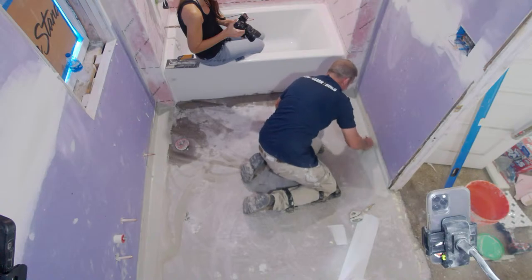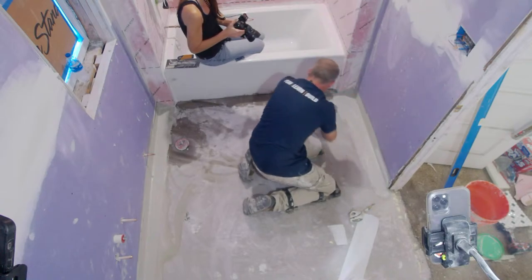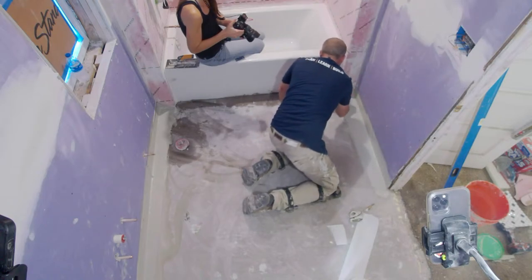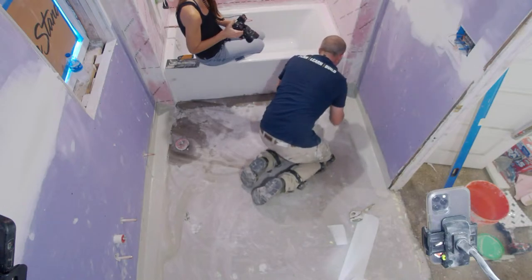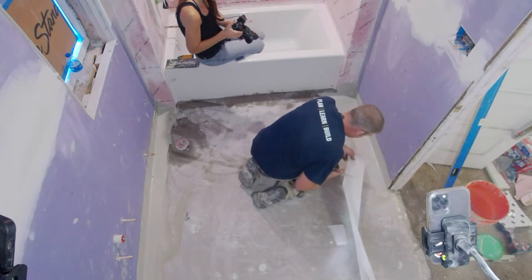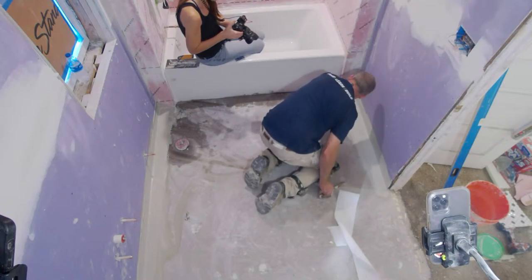Those first jobs I did, the really small mosaics on a floor, were an absolute nightmare because I didn't have the floor flat enough. And they went with a dark grout on white, and that really highlights a lot of stuff, having that light tile with dark grout over it.